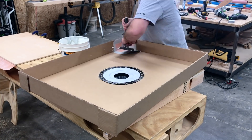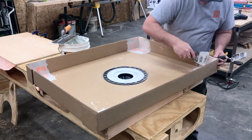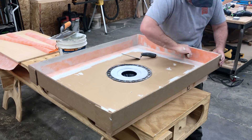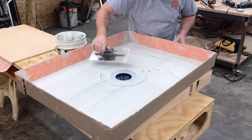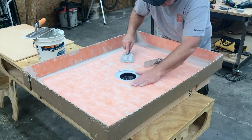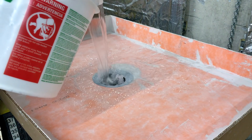Now it's time to install the KERDI, starting with the preformed corners. It's very important to key in the mortar — this means pressing the thinset in with the flat part of your trowel to ensure a mechanical bond with the substrate, then use the notch side of the trowel to set the thickness. I put the corners in first, then the vertical banding, then the horizontal banding, next the walls, and last the floor. You'll notice the horizontal banding doesn't go all the way to the corner — that's because the preformed corners are designed to get a two-inch overlap before the corner so there is less buildup. Here it is completed and ready for water.